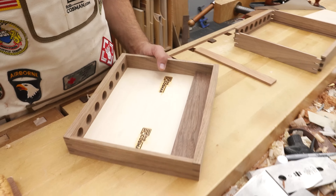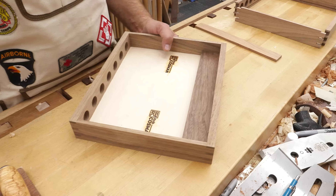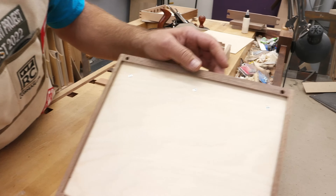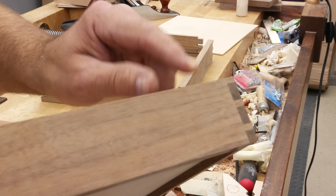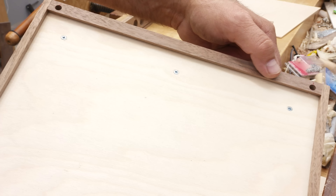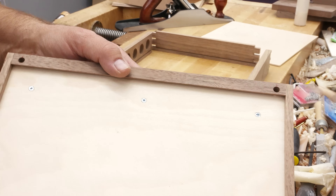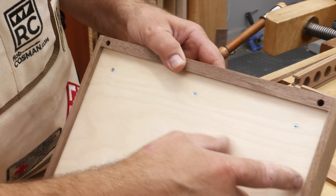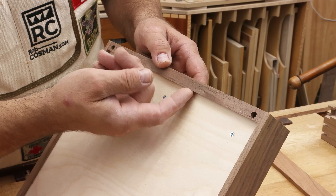Underneath here there's a magnet buried so that it holds the chisel in place, but you don't have to look at it. Before I put the box together, I took this piece — and by the way, those holes are there because there are magnets that come almost to the surface, and that's what holds the lid on. I undercut it to give an angle right here that the French cleat, or the other piece that will attach to the wall, will be able to hold on to.